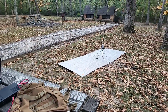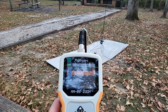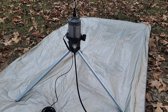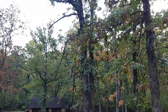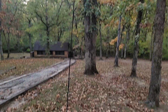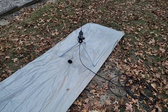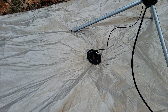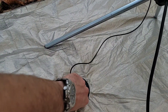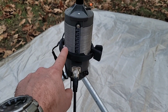We'll show how to use a RigExpert here to set the coil. This is the Big Kansas Coil running on 20 meters with the 7-section collapsible manpack whip that's 112 inches. For the ground plane we have the Ozcloth Faraday Cloth mat, which has grommets in the four corners and a center hole that allows you to attach the ground radials by a banana plug. The ground radials connect on the side, and you adjust the coil by moving this tap up and down.